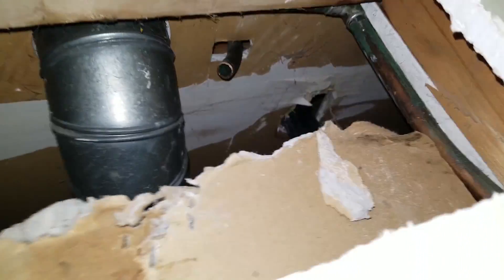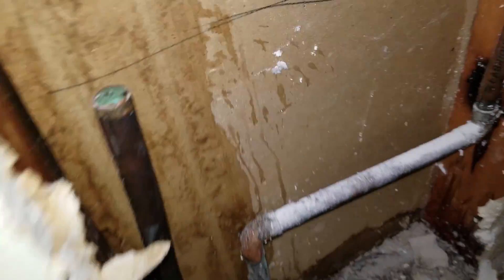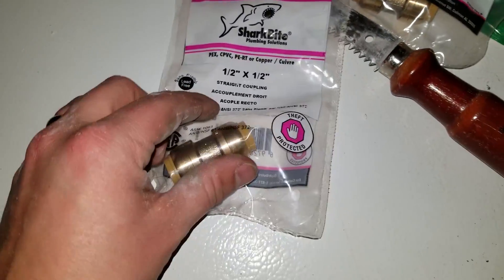Things have gotten a little soggy. I got a dry-out place down and I've cut the pipe here — had to go all the way up there, so I've got some drywall to fix. Instead of putting new copper pipe in, I'll be using these SharkBite couplers with some half-inch PEX. But I wonder if I can melt the old pipe down and turn it into something.